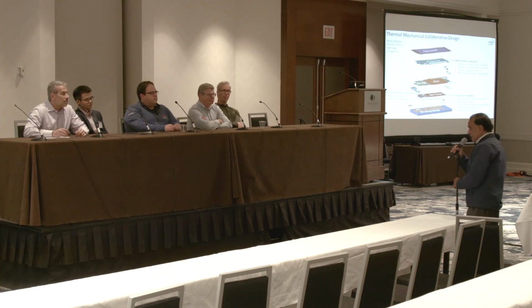In your designs, do you actually build not the CFD thermal model, but the real PC board model, a thermal model with a thermal chip? It's important. And you mean in the simulation or? Not simulation. Do you actually plan on building? This device that I showed was completely built, from start to end. No. A thermal board. Do you build a thermal board before the actual PCB is made? We do that, yes. And we call it TTV.